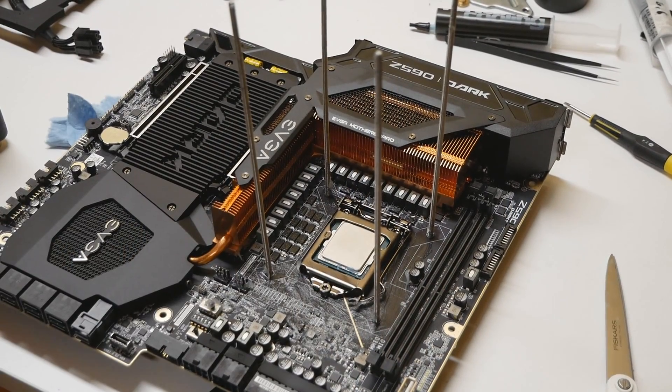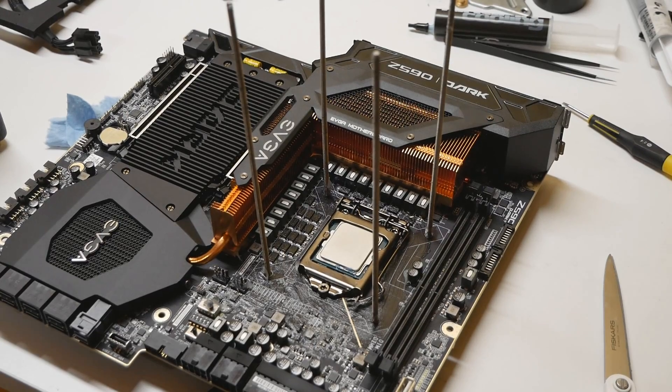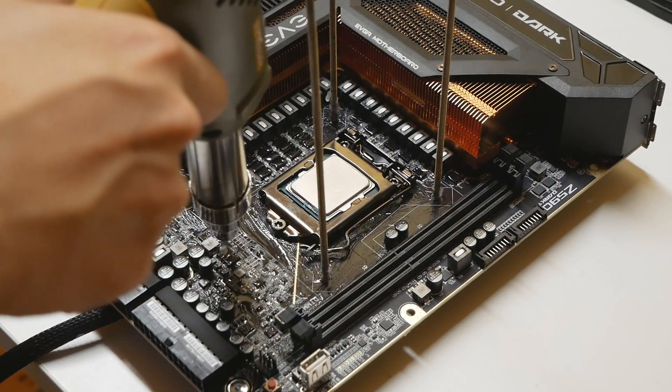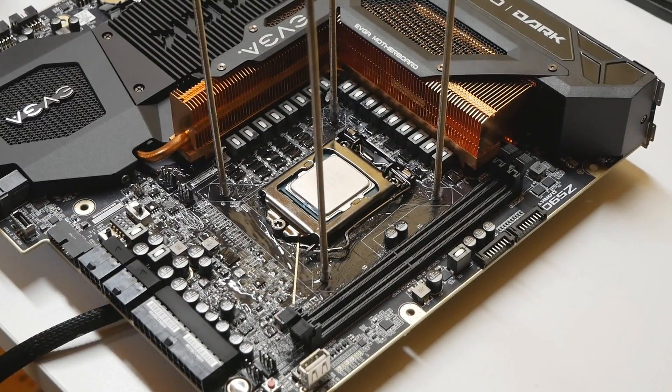With graphics cards like the 2080 Ti or 3090 KingPin I always do it this way: apply one layer of Vaseline, heat it up across the whole surface until it liquefies, then wipe it briefly again with more Vaseline. That's generally a very good technique. After using the heat gun, the coating looks quite good — let's move on to the next phases of insulation.